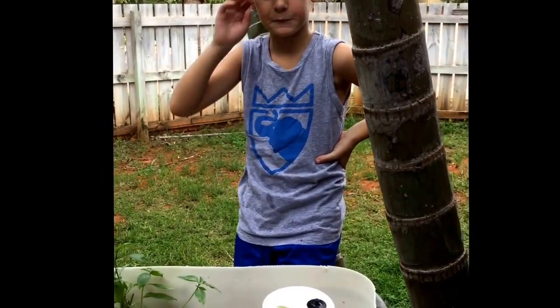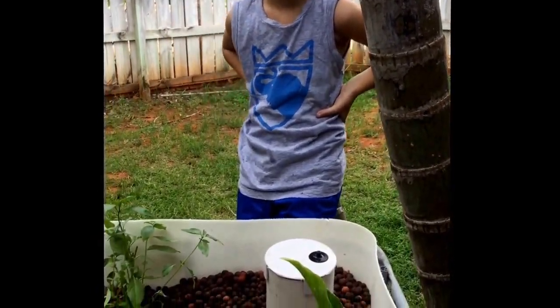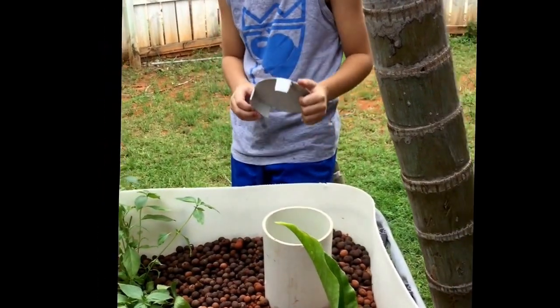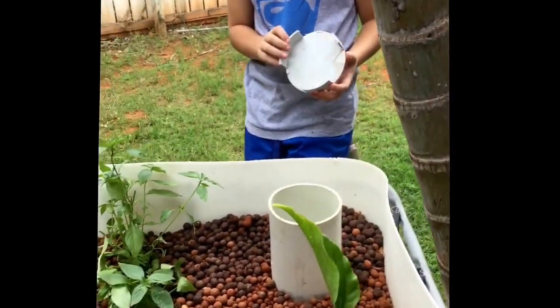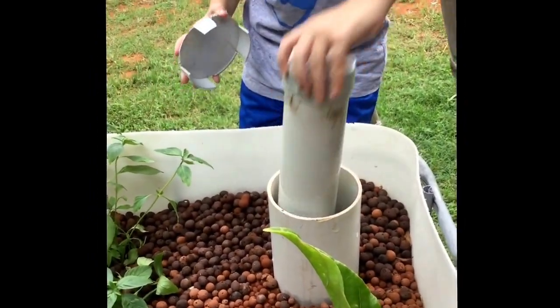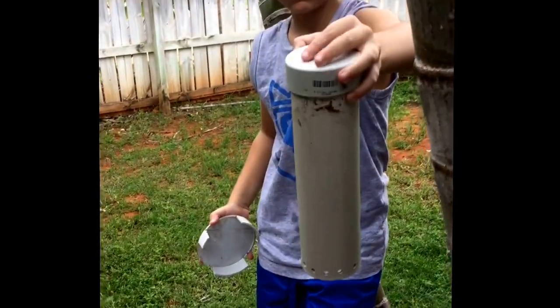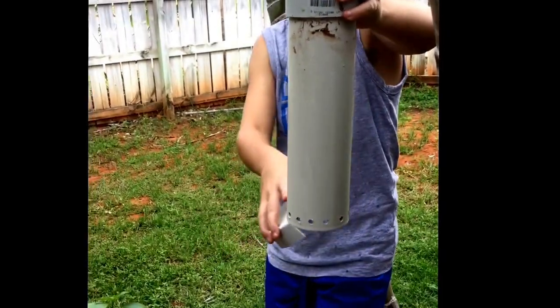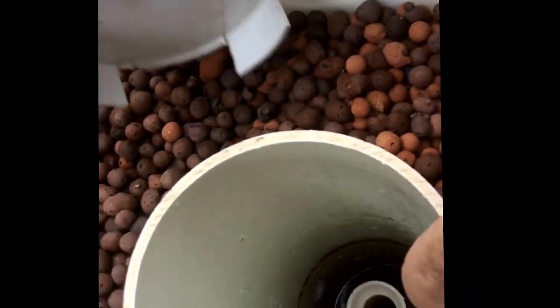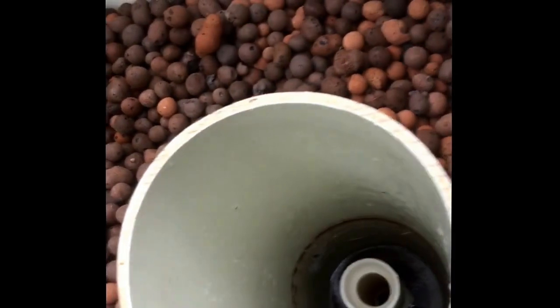So the water comes in and pushes all the air out. We'll have a look inside. So as the water comes up, it pushes the air out and causes a suction. Lift out the pieces inside. And so then the water starts draining because of the suction. And how does the suction get broken, Johnny? By these holes — the little holes in the bottom let some air out. Leave it out for a second, we'll just have a look inside. So here's the standpipe. The water will never come above this standpipe here before it starts to drain back off again.